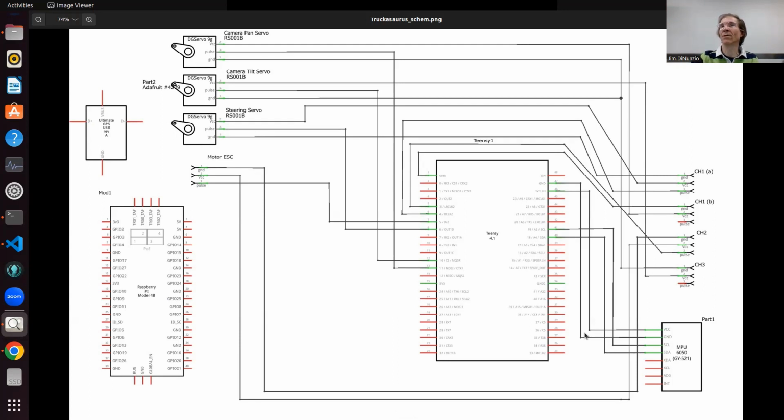People have suggested you can use hardware electronics to do that, with some NAND and AND gates and whatever. You could just use gate logic. But I thought, I may want to capture the steering in the software so that I can use clone training, for instance, in the future, where I drive the robot around the track, all the steering data is captured, and I use AI to train it. So if the software way doesn't work so well or causes problems, then I could always go back to gate logic where it simply forwards the signals through a single switch. It's a select, like a chip select, so it will say send this or send that. But I haven't done the hardware solution right now. The software one is working fine. So in the future, I might do that as another way.